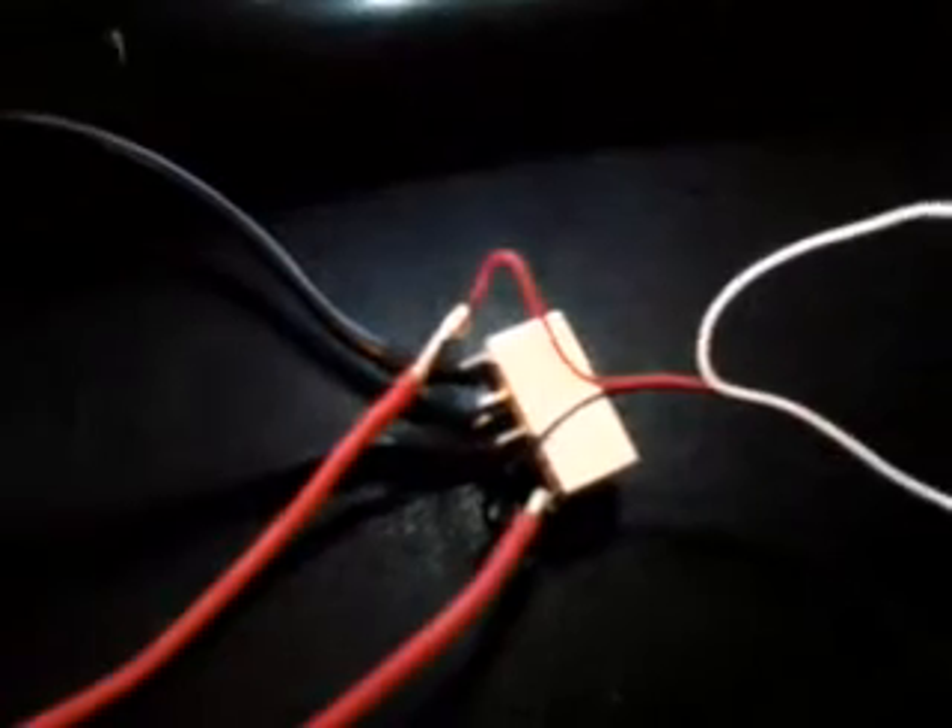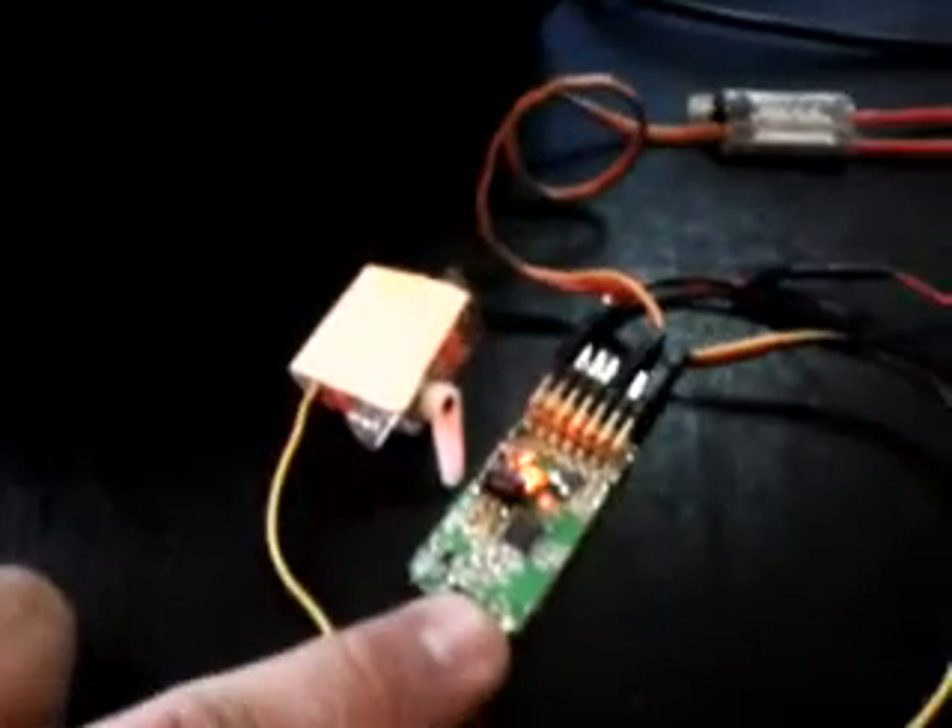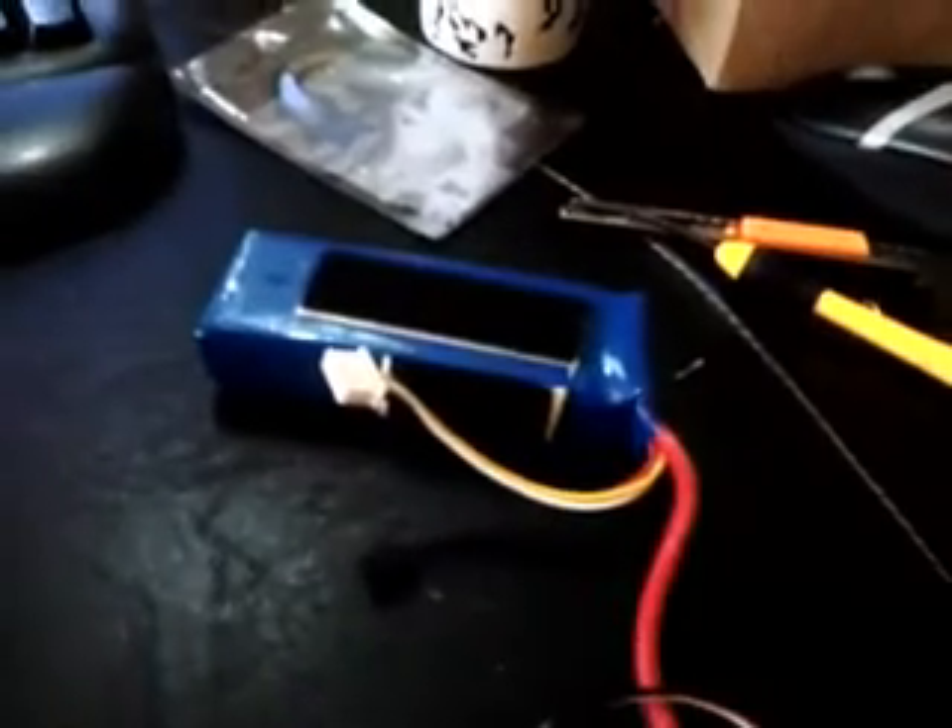Simple as that. I hope it clarified all your doubts. This is a good way to use a 5 volt DC relay, and at the same time power your receiver — and a servo here is also working — using only one power supply, that battery over there. Hope this helped. Bye-bye.